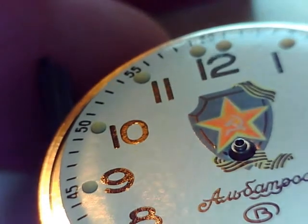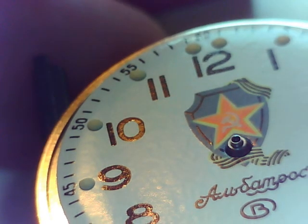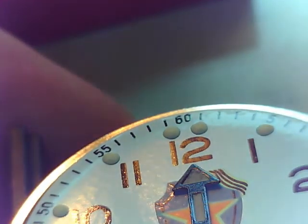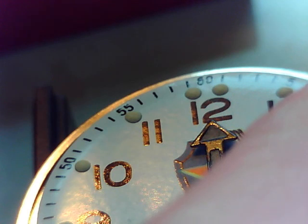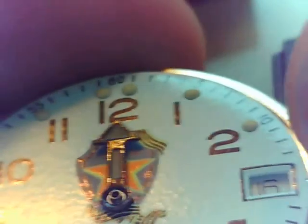Let's put an hour hand on. We leave it right there. Grab the hour hand. This is another time where I like to just gently lay it in there. I'm going to square it off to the 12. Center it on the 12, center it on anything else that you might see there. That looks pretty good. And I'm just going to lean on it with the tweezers. I'm not going to set it because I'm a little goofy. I'm anal about these things.